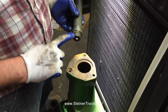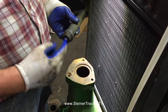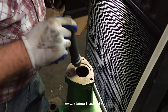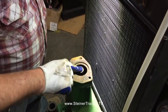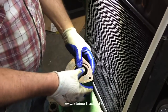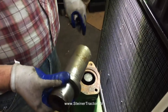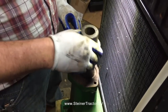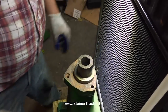So I've already started my bushing down in the bore with my driver like this. Smeared grease all over everything so the bushing stuck and held to it. And my driver, unfortunately, is just long enough to get started. But as you see, it only goes in there so far. So using my fancy John Deere wheel bearing or some sort of a bushing to keep things lined up, this actually just fits. It's from a John Deere 44 plow.